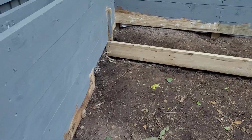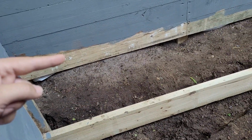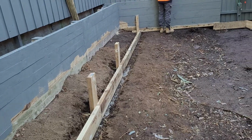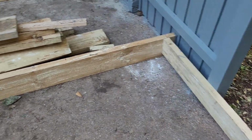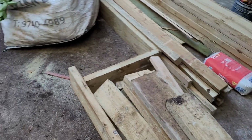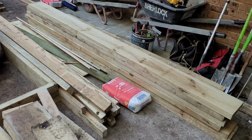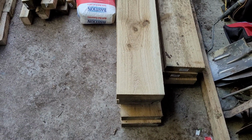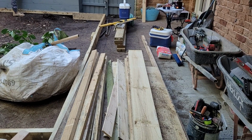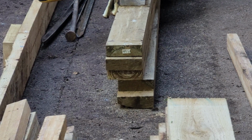Today we try to make a frame for the decking area. This is a bench area going there, and this is the frame of the deck around it. This is an L shape. We need to install the screens for the bath in that part. And today we installed the structure for the decking with H4 timber sleepers, 200 by 50 or 150 by 50, the other one we normally use. This one is 150 by 50 H4.